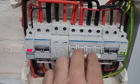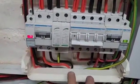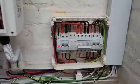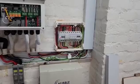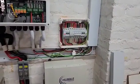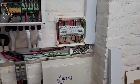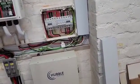That one is on those two, which is now the inverter feeding it — it's on inverter now because we're testing. We'll still put the names on the circuit. The inverter goes down there, then it goes to the house — about 20 meters to the top floor. We've got the main DB and our sub-DB inside. The sub-DB has a 63 amp earth leakage, then the plugs, lights, and we've got to pull the pump in as well.